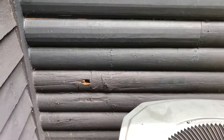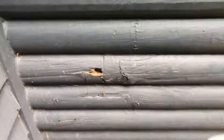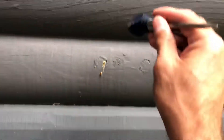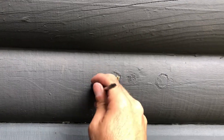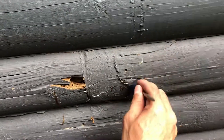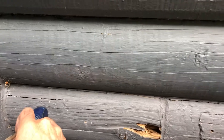What matters is if they did it correctly, and what I'm seeing is that they didn't complete the repair correctly. Here's my ice pick — I like an ice pick with a metal backing on it. So when you tap on the wood, you want to hear that nice dense sound. But as I tap further down — obviously a woodpecker has gotten in here — you can hear that it's just dull and hollow sounding, and you can actually push on that.